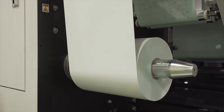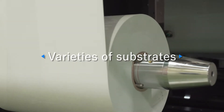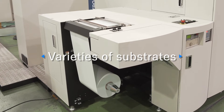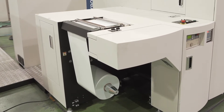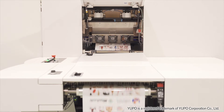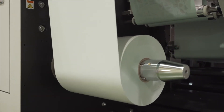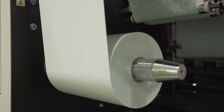MJP13LXV supports substrates with a thickness of 60 microns and a width of 152.4 millimeters up to a maximum of 342.9 millimeters. It enables printing on Yupo, PET, PP, glossy paper, tack paper, and tack film that are often used for label printing.